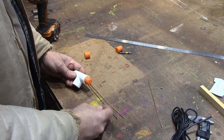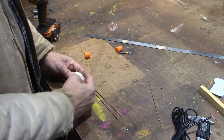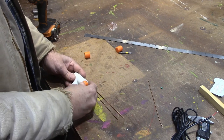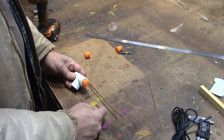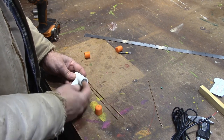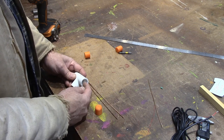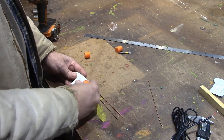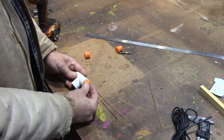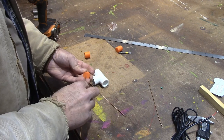If you don't have a 3D printer, you could probably take a dowel and whittle it down to fit up inside the PVC, then drill a hole through the middle. This is half-inch PVC, so you could also use a piece of half-inch pipe inside and keep reducing until it's small enough. You'd need to whittle some wood or plastic to fit and drill a hole, but I just 3D printed these pieces.